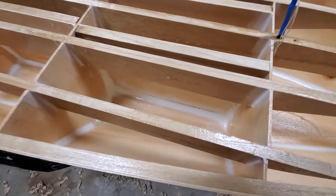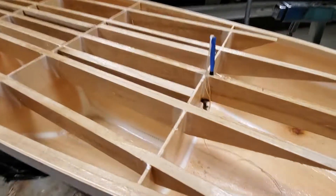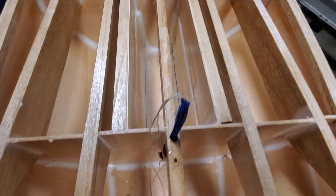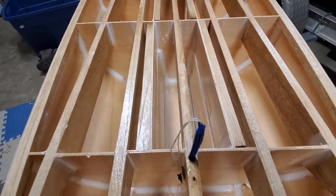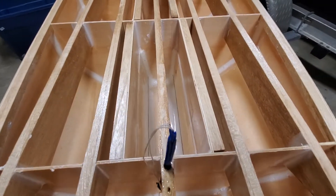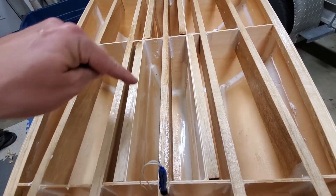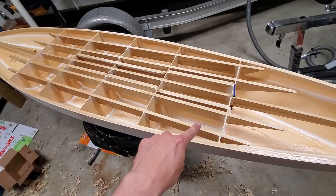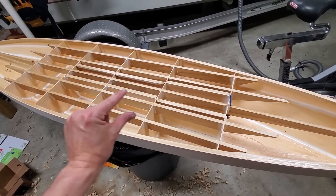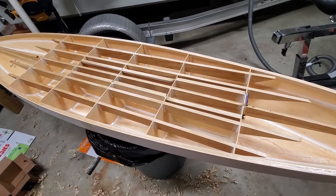The foil track boxes are glued in with the board flat on a table. I came up with a way to reinforce them, which is like a little plywood T on top of the tracks, and I also added an additional web that sits on top of that and comes up to the deck. So there are essentially full bottom-to-deck longitudinal bulkheads through to this level here.